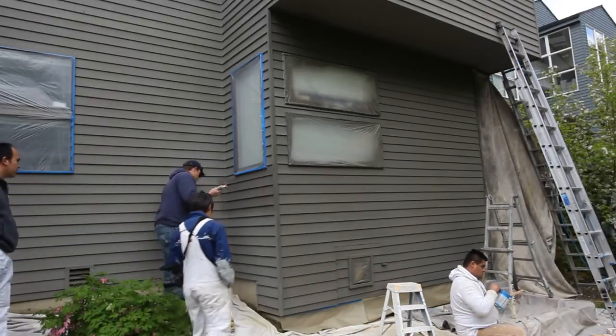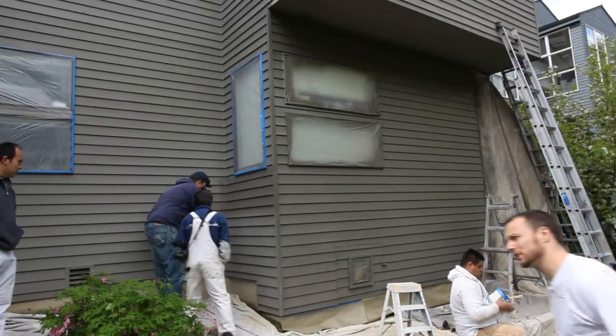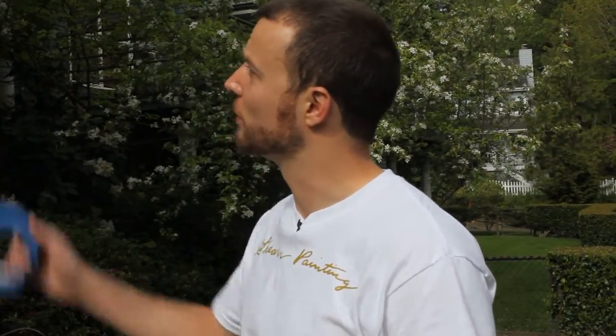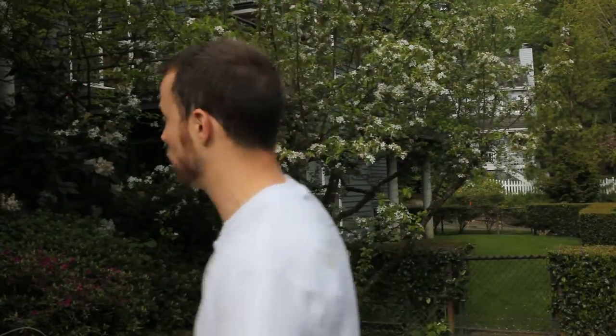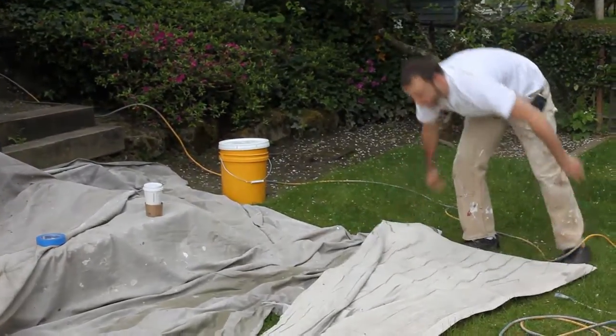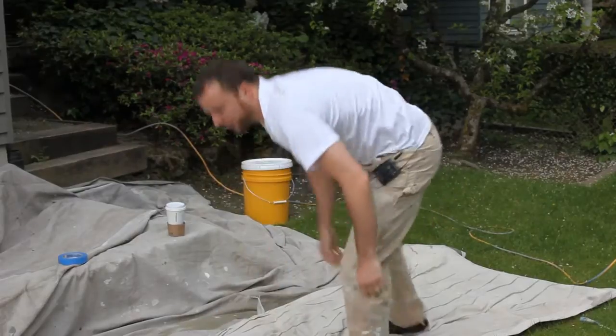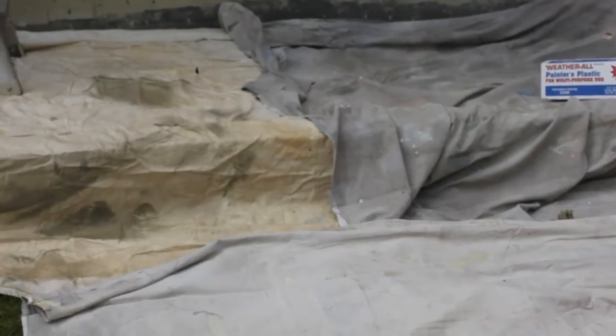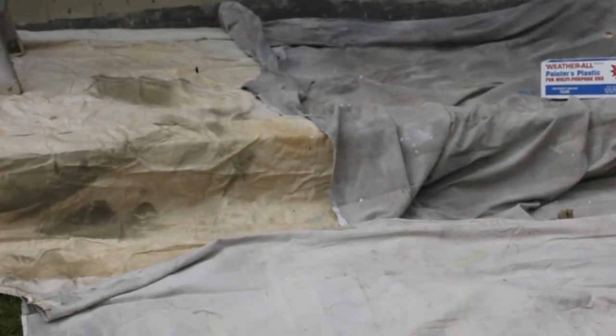Have you seen what the sheen's like when this stuff dries? I know, that's why I wouldn't want to back brush it. Why mask? We're looking in short to not get paint on anything that's not supposed to get painted. We're starting off today with the windows — these are aluminum frame windows. So we're going around with a perimeter line of tape, then putting plastic through the inside, and then going back to place individual pieces of tape to do what we call a French cut.